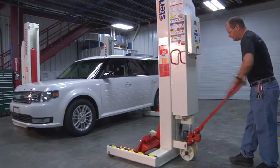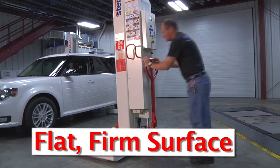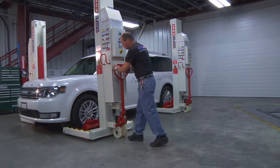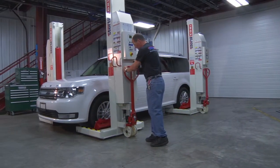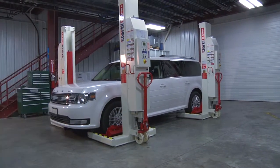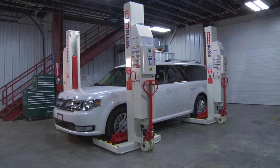As a starting point, always place and operate mobile lifting columns on a flat, firm surface in compliance with the requirements laid out in the original equipment manual. If the lifts are to be operated outside, it is necessary for the technician to be aware of wind loads against the vehicle when in a raised position. Maximum allowable wind loads are detailed in the original equipment manual.